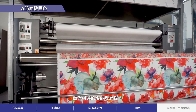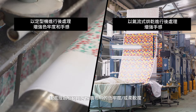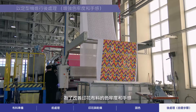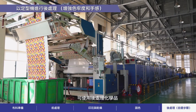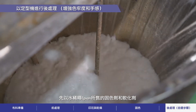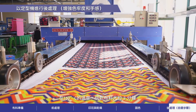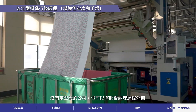Additional optional post-treatment processes may also be completed at the request of the customer. Post-treatment processes can be applied to improve the fastness and/or softness of the fabric. To improve the fastness and touch of the printed fabric, post-treatment chemicals can be applied. Dilute the fixer and softener liquid sold by Epson with water, apply the mixture using a stenter, and dry the fabric at 160 degrees Celsius for about 3 minutes. This process can also be outsourced for companies that do not have a stenter machine.